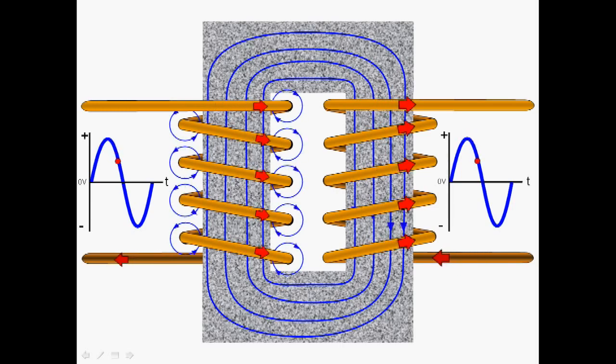We've now seen how a voltage and current flow can be induced in the secondary. The induced voltage depends on the strength of the magnetic field and the number of turns on the secondary coil — more turns on the secondary will generate a larger voltage. The strength of the magnetic field depends upon the number of turns on the primary. So the voltage output of a transformer depends on the relationship between the number of turns on the primary and the number of turns on the secondary.